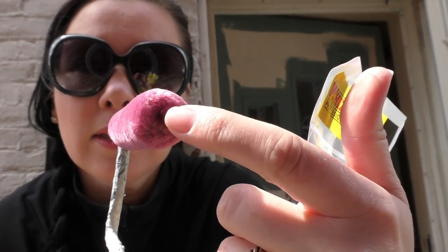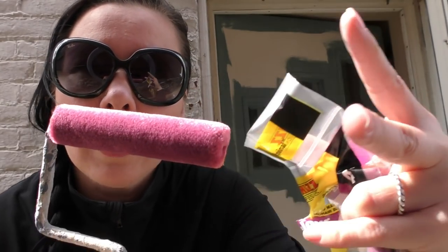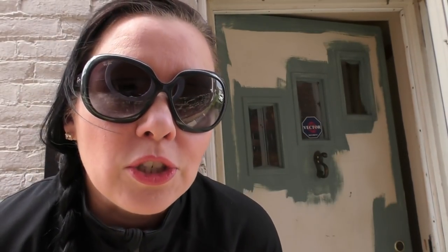These rollers are what's called low nap, and they're also called velour. They are a really nice low nap, and because they are so tight to the very center, instead of using a sponge that would release bubbles and air when it squeezes and presses on the surface, this keeps it nice, flat, and professional.